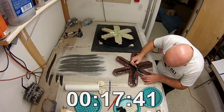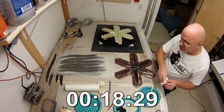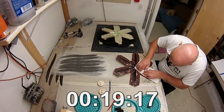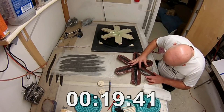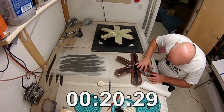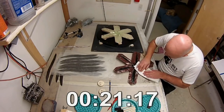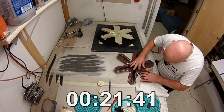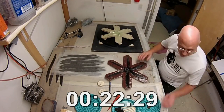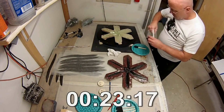I always put a liberal amount of resin on every layer so it's almost squishy, to ensure proper penetration through all layers. Then I take paper towel and basically squeegee against it to extract every bit of resin that won't stay in the mold. It's really important to keep making sure the trailing and leading edge isn't getting pushed out of the perimeter. I go through all six blades getting every bit of resin out because extra resin is weight, not strength. Once I've groomed the leading and trailing edge, that half is done. Now I mix up another batch of West System for the back half.